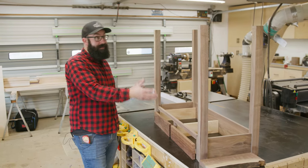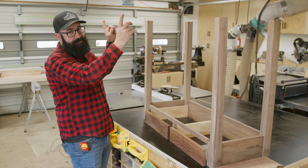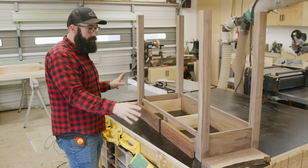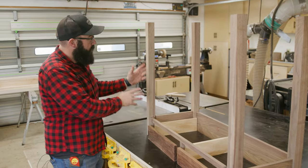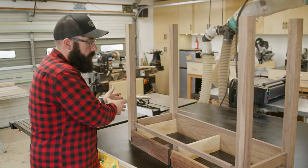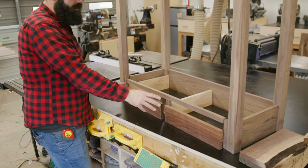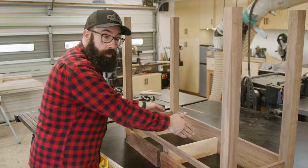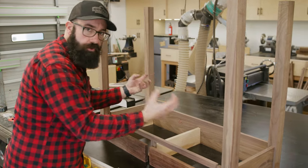I just quickly mocked all the parts up so we can kind of see what it looks like. Obviously it's upside down, so the legs won't be facing straight up — that'd be a weird table. The next step is to get the side assemblies together, and everything's going to be done in sub-assemblies. We're going to taper the legs and attach the stretchers to the legs — we'll do that for both sides. Then we're going to do the face frame and get all that connected together. These partitions will hold up the slides for the drawers, and will connect the front and back in a more sturdy way.